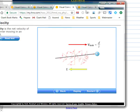When wires heat up, or your ballast heats up too much, it breaks over time. Okay, so here's what's going on. When you heat up whatever your electrical component is, the wire, the ballast, then it creates more resistance, which means there's more wear and tear on that. Also, when you have resistance, it provides heat. That energy of trying to get through, essentially friction, produces heat. So when you have a hot wire, higher resistance, and then that higher resistance producing heat, it gets hotter and hotter until you start a fire. That's what can happen if too much current is pushed through the thing.